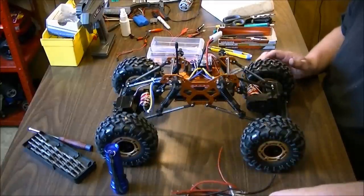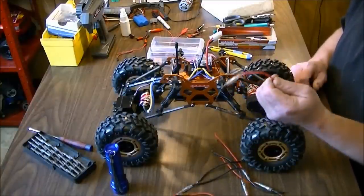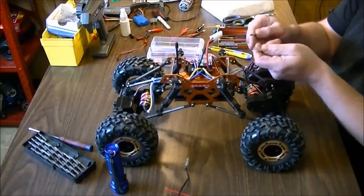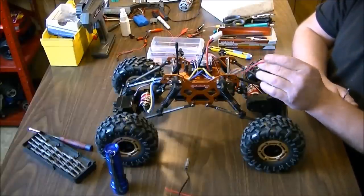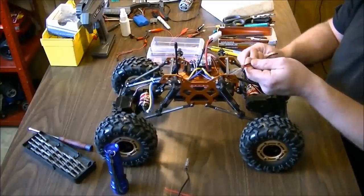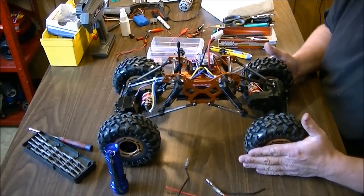As soon as I'm done making my cables and installing them, I'll show you what the finished product looks like. You can buy silicone wire at a lot of hobby shops online — you just need this thicker gauge stuff. If you have to, you could use lamp cord wire at a pinch, but you're definitely going to need these connectors if you don't want to be soldering, because you've got to watch your polarities. You could do it one wire at a time, but I don't want to mess with my connectors or chop them off.